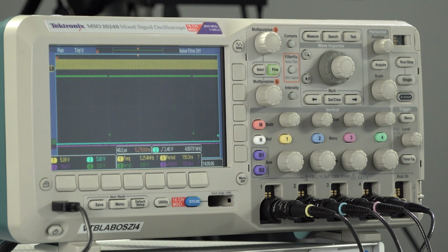As I turn the shutter switch from 0 to 1, the exposure time is cut in half. The violet trace of the DIS terminal is now high for half of the time. Also, the signal height dropped significantly. The other two positions available make the exposure longer again, 2 and 3. Now the signal is again saturated. So back to 1 to have a useful signal and a fast readout.